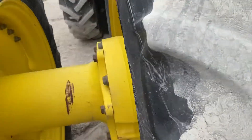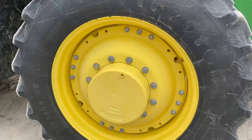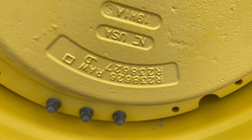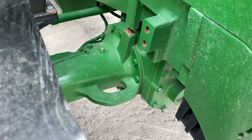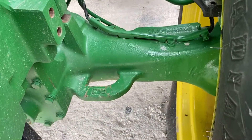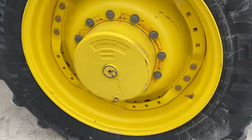There's another 1500 in wide spacing, and here's our 1300 front axle, so we're going to cover all three axles. The only difference potentially is there are a few higher horsepower 1300s that have four planetary gears — the part number tells us which one it is. Same thing on the 1300: we sell the axle assembly complete less the final drives, and we have been selling a few updates. We can take a 1300 off of an 8010, 8020, 8030, or even an 8R series and put it on an early 8000 to replace the three-piece axle.